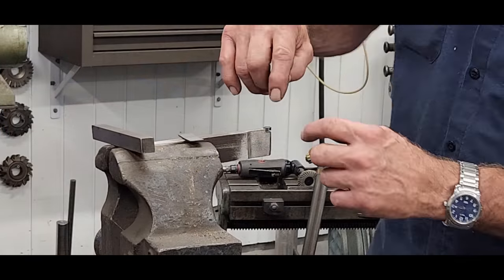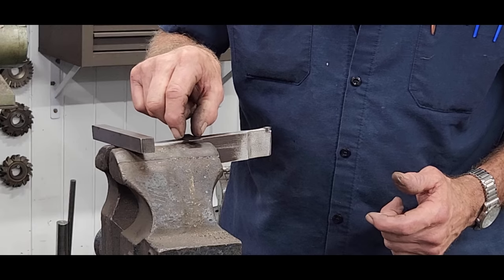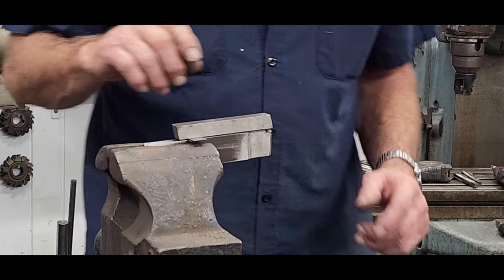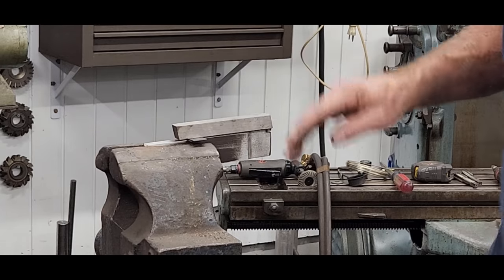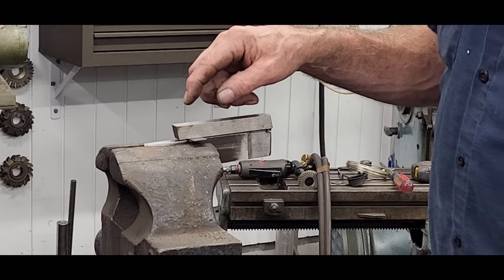All right, we're gonna go sand the end of it and we'll come back and then we're gonna mount that on there. Okay, I've got the insert here and I've got flux lubricated between the holder and the insert. I have this little shim right here because once I start getting it hot, I want to set this just like this, and that'll hold that insert level and pretty much a little bit positive rake, but not much. I can see the amount in there. Very, very little.